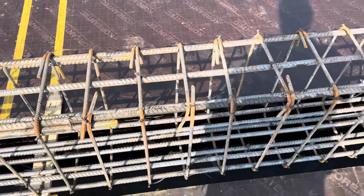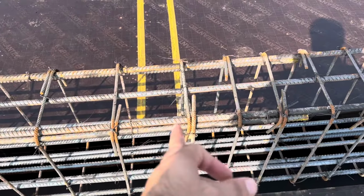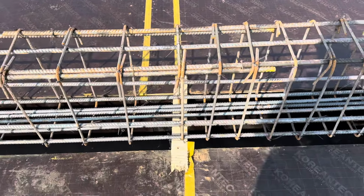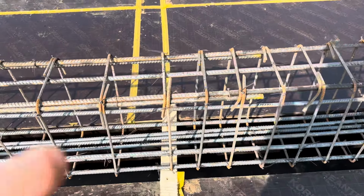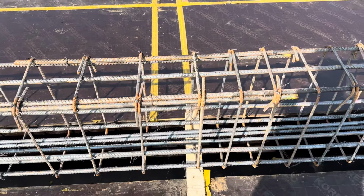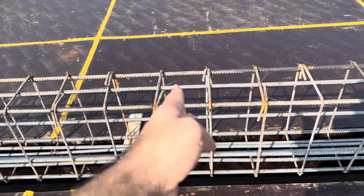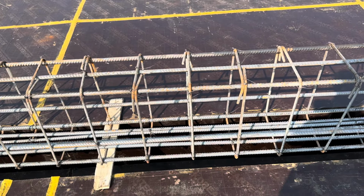If you see, they made one of the big mistakes in this construction, which is the lapping length. Lapping is not allowed at the distance of L/3 or L/4. But if you need to provide lapping to extend the steel length for the floor beam or the slab, we should not provide it at L/3 or L/4, where we have more chances of cracks. But you can provide it at the distance of L/2, which is 15 feet. This is the place to provide the lapping, at the upper portion, not at the bottom portion. Here we have positive bending moment at the bottom.